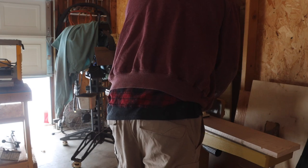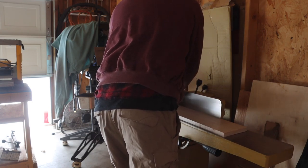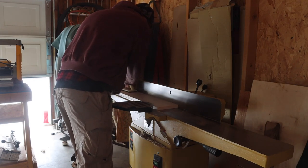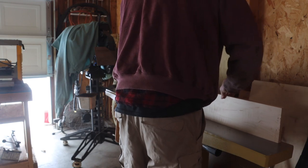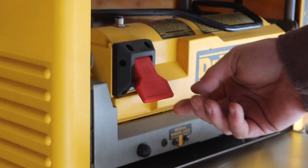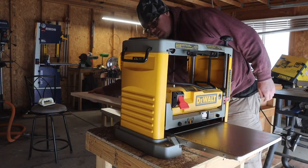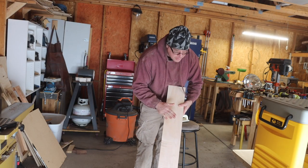The glue for the little panels is drying but that's not going to stop me from moving forward. Right now I'm back on the mill — we've got to mill down some curly maple. I love curly maple, I love walnut, and I hope they go good together. We're going to get it jointed, planed, and probably over onto the table saw or miter saw to start cutting some pieces. I love the look of curly maple once it starts cleaning up.